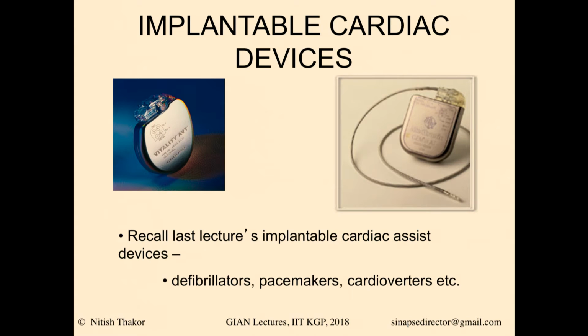So first of all, it's in a titanium can, titanium box. Why do you think it's in titanium? It's inert. What is another thing about titanium? Okay, biocompatibility is same as inert, very strong, non-corrosive, and so on. However, working with titanium is also very difficult, and one of the most important things they have to do in designing such a device is to make it what's called hermetically sealed, which means no humidity at all can get in. So it has to be sealed perfectly. If any humidity gets in, it will short circuit the electronics. And what is body? I mean, body is warm, humid, salt. What happens when any metal is put in warm, humid salt? Corrodes, right? Degrades very badly, very quickly. So it's the worst degrading environment you can imagine.